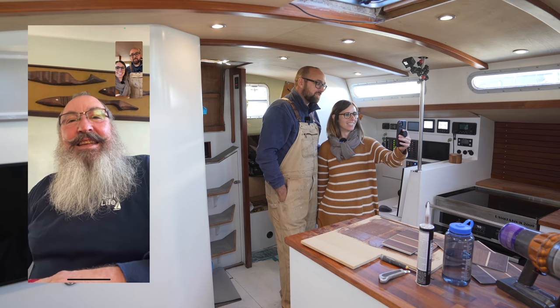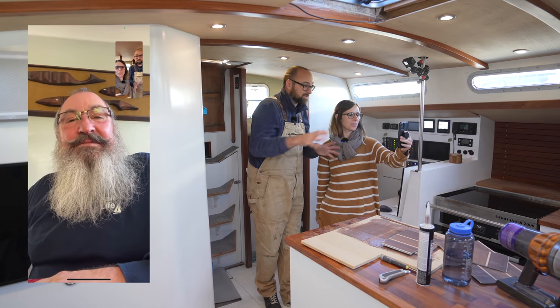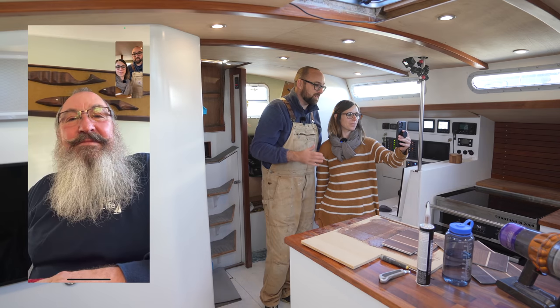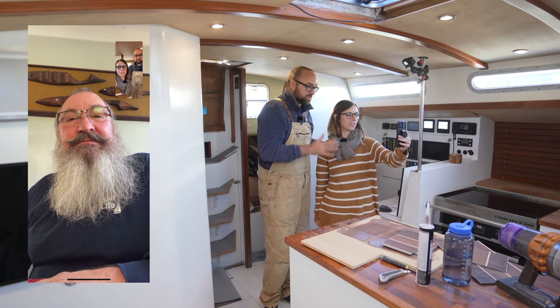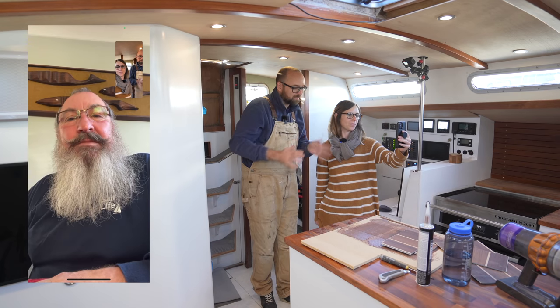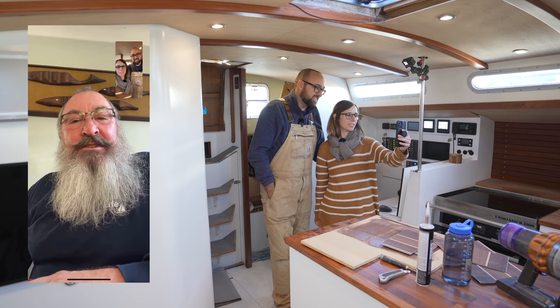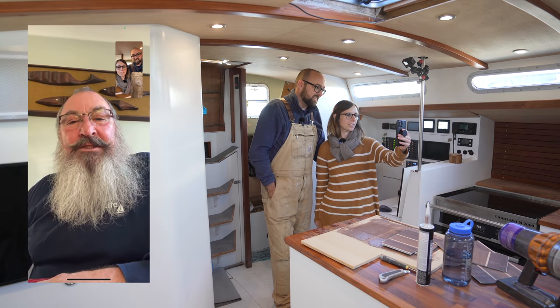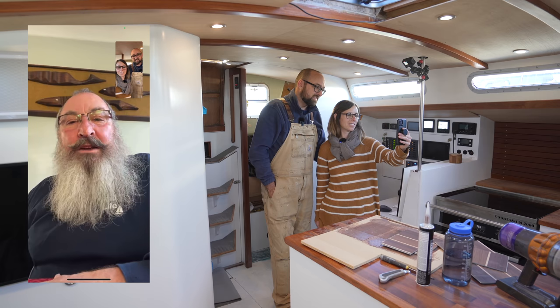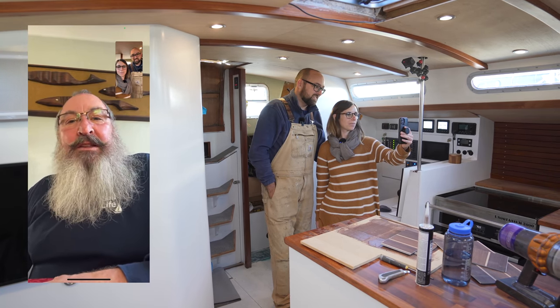So the first question is, this is a pretty small area, but it's got lots of nooks and crannies. How do I figure out where to start? Do I want to start with a full board, or do I somehow want to cut it a little bit smaller? How do I figure out where I want these stripes and whatnot? Well, usually I ask my customers, or we determine the main viewing point, the first time you walk into a home or a room and you look at the floor, you like it to be balanced out.